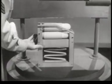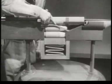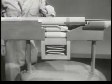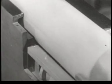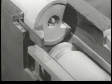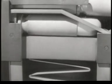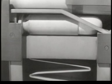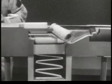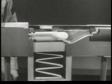Now let's install the magazine into the receiver. The magazine is placed so that the top cartridge pushes against the underside of the bolt. When the bolt is opened, it slides back until the face of the bolt clears the rear of the cartridge, then the cartridge is fed up into the path of the bolt. As the bolt comes forward, it strips the cartridge from the magazine and chambers it, and the spring in the magazine moves the next cartridge up into position. Now each time the bolt is opened, a cartridge is waiting to be chambered. That's the last step in the cycle of operation: feeding.